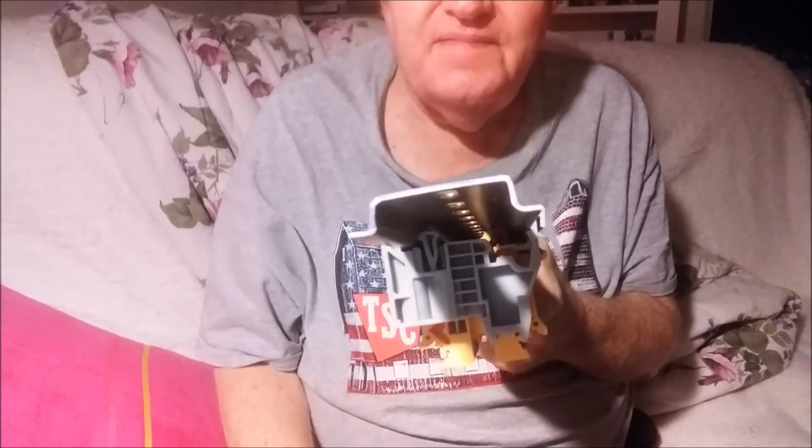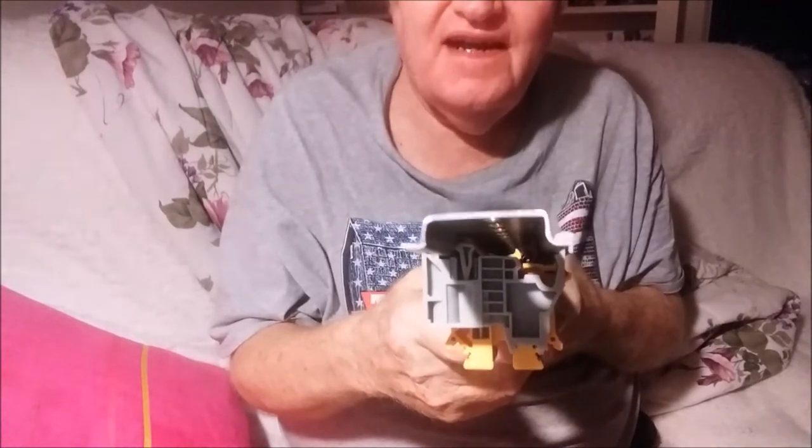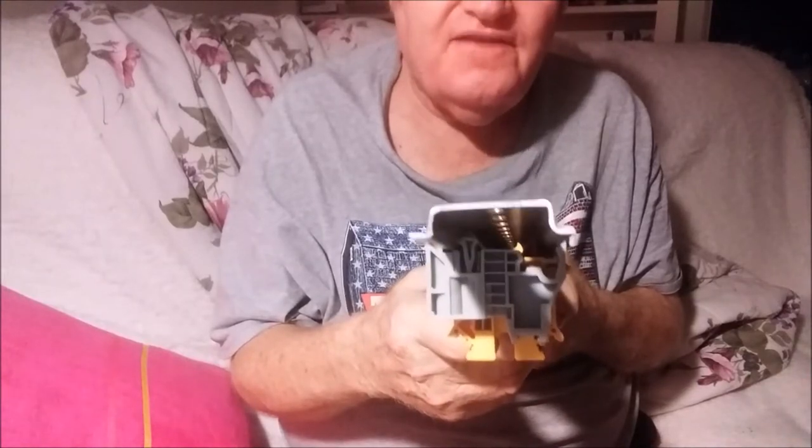I've only ever used C and the industrial ones. The industrial ones are the same thickness of metal, same flanges, same base, same slotted holes — but the vertical height here is about twice as much. One is more weight so it costs more, but the fuse holders touch the base plate and snap onto the DIN rail, making it more stable when you're popping fuses in or out. They have a sort of mechanical escapement so there's not much load.